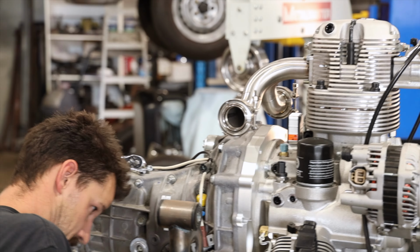I think that's where, when these get ceramic coated, we can make a couple of heat shields, especially for right here where the spark plug is. We can run a high temp spark plug boot that goes over top of these, like a sheath that goes over your spark plug wires. We could also pick up these two bits and make a small little plate that goes in between, which will help dissipate the heat away too. But we'll get everything finalized, fitted where it's going to go, tacked into place, and then we'll rectify those areas when we need to.